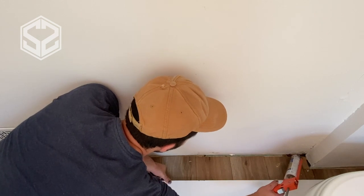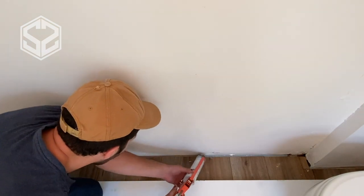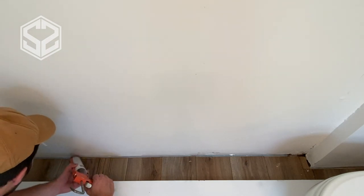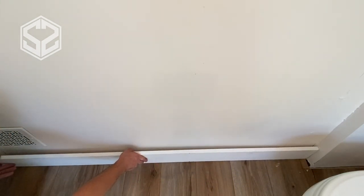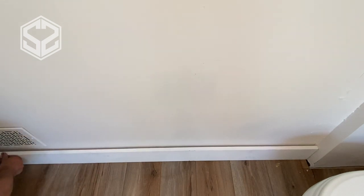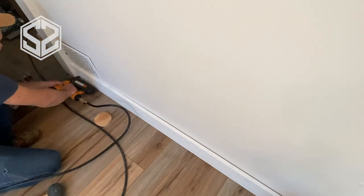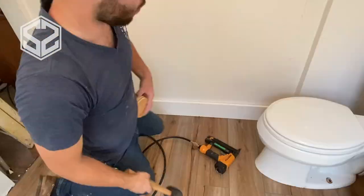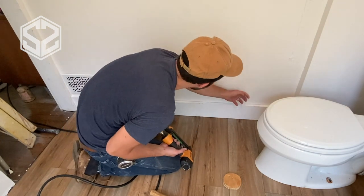Now I'm going to go around the room adding in the baseboard, finishing off the floor even more. Now in order to achieve the full waterproof effect of the flooring, you need to add a strip of silicone underneath the molding around the border of the floor. Now if you don't do this, it will not be waterproof — water can actually leak underneath the molding in between the flooring and the molding and cause a lot of damage. If you have a room that's constantly going to get wet, like a bathroom where the shower is, you need this to be waterproof. So make sure you add that silicone bead underneath the molding and then you don't have to worry about it.